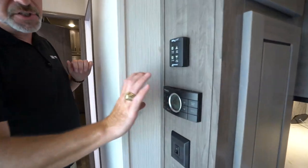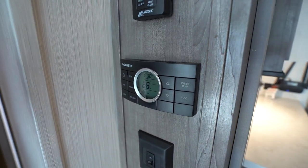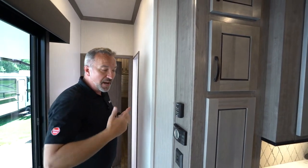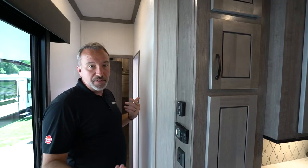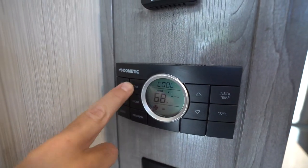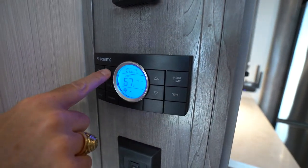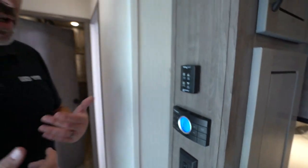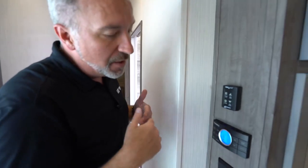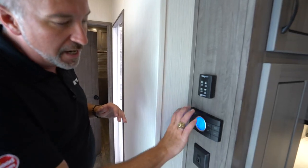With the Cedar Creek Cottages, you're going to have a Dometic ducted air conditioning system inside. You're not going to have the units in the ceiling with the quick-cool dumps — everything is going to be ducted. You'll either have a 15K, a 15 and a 13.5, or dual 15s, controlled by zones. To change the mode, hit mode; zone to change the zone — one and two for front and rear — and adjust your temperature up and down for both. If it's hot outside and you want to cool down quickly, make sure the fan is on high, because on auto it's going to cut on and off, which could cause the unit to freeze up.